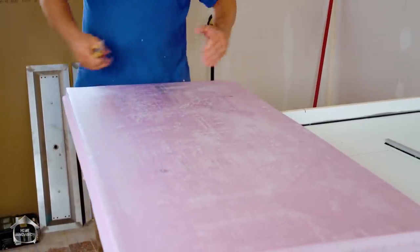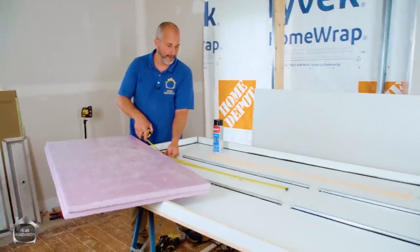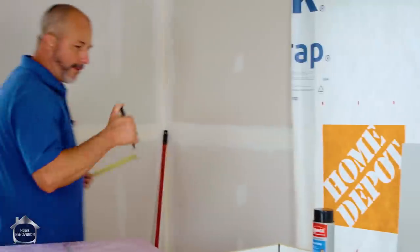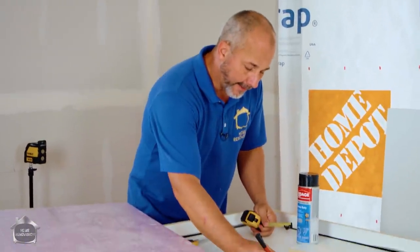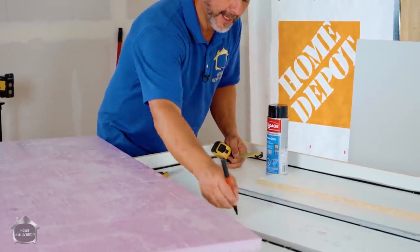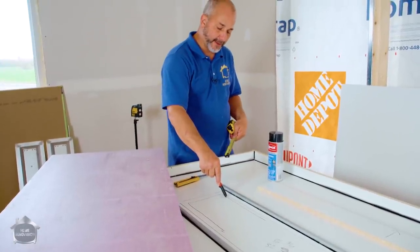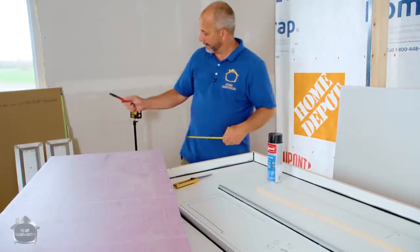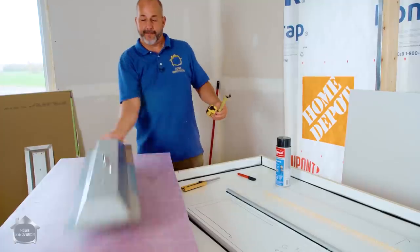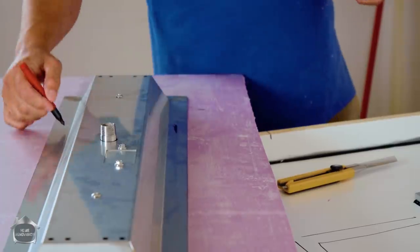Okay, so that gives me two relatively straight edges here. So my hole, the insert is 32 by almost 8.5. What we want to do is find something that fills the space and leaves at least half an inch on both sides so that my concrete will come to here, my finish comes to here, because it sits in real nice. Here, I'll just bring this out for reference. Here we go. Right? So I want my concrete to come up to this point on each side.